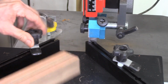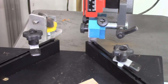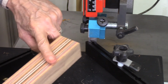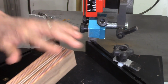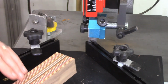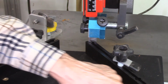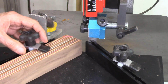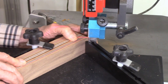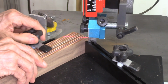I have my strip all ready. I'm going to be cutting wedges at 5 segments per ring. And I'm going to be cutting like this because I want to round this off to get my Dizzy Bowl pattern. So I have it set for 5 increments or 5 segments on my plate, and line my first cut up so I can do my first cut.